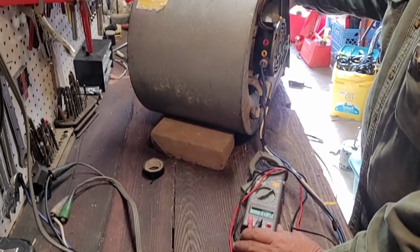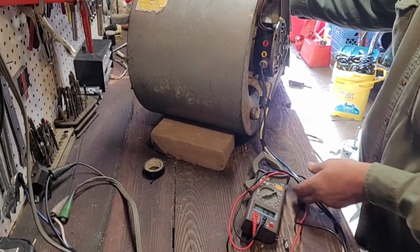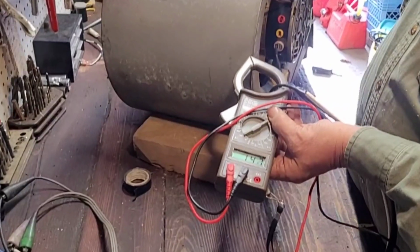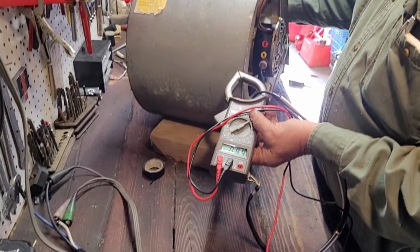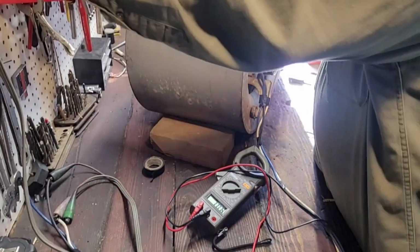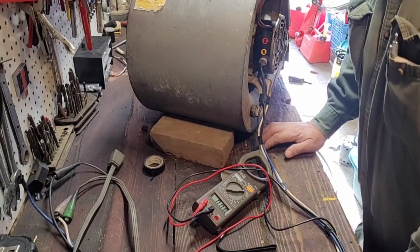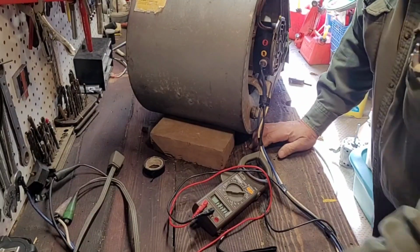So when you back off this blockage I have in front of the wheel here, you can see it raises up. It's raising up 13, 14, 15 the more I release it. So that's why you got to have that blockage. Don't block that blower. Try to run one of these without any metal in front of the wheel, then that's why they'll overheat and they won't run very long. They'll just cut out.